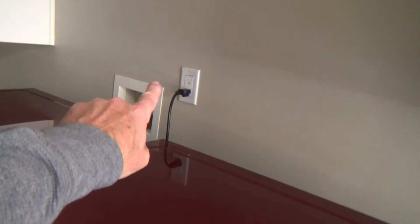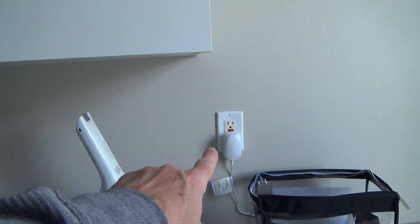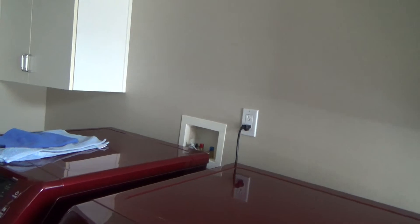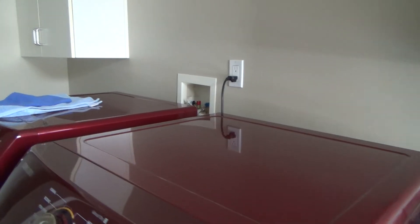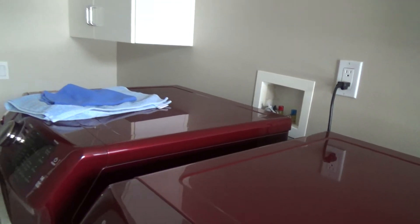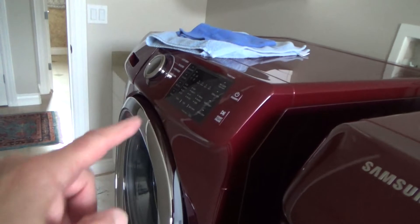At least I got that figured out. This one here for the washing machine — that was on a separate circuit, I believe. I don't think that's connected onto there. Generally they don't do that — usually they'll have a dedicated circuit for that. I think we saw one in there that said 'washer,' and for the dryer they would have a separate thing. If it was electrical it would be bigger than a regular 20-amp breaker, but I think this is connected to gas — I'm not sure.